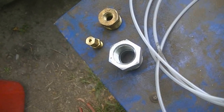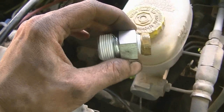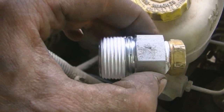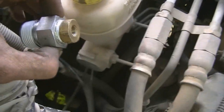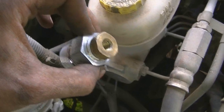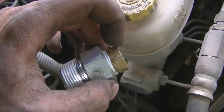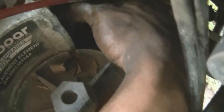You can see the plug is no longer there and I've got my fittings. I've got a half inch to three-quarter with Teflon tape, and the three-quarter inch Teflon taped. I'm going to feed her in there, then I'll put the compression fitting in because my socket won't fit over the compression fitting. I've got her in — just get her finger tight and I'll torque her down with the wrench.